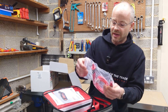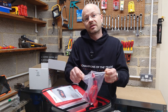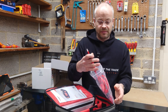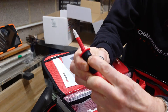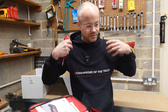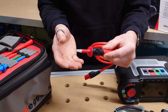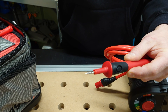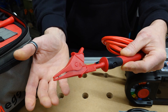And another test lead — this one has the button on it, so you don't physically have to touch your tester to run the tests. Quite literally, just plug this one in, push the test button, and it will run it for you. Makes it much easier, especially when you've got your tester around your neck. The auto-lead also has other fantastic features — you can remove the cover off the end, which will allow you to attach a crocodile clip, making it so much more versatile.